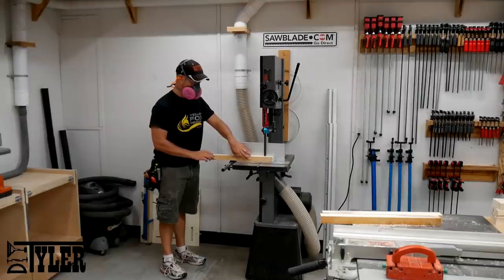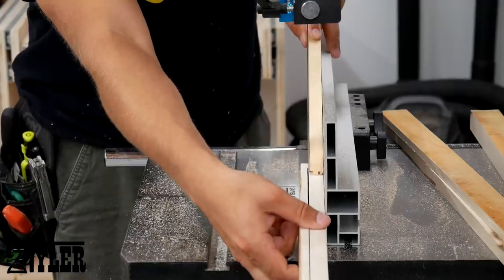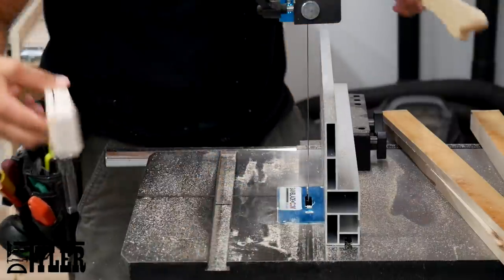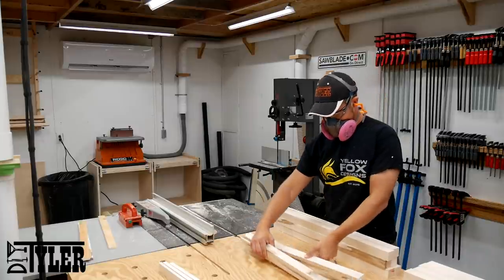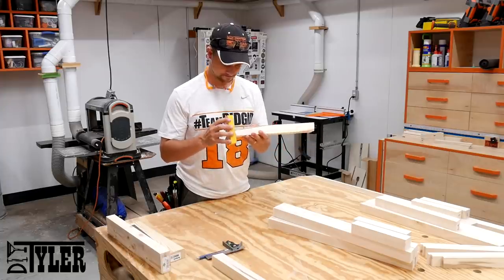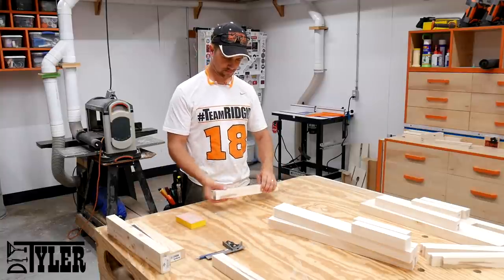There is one small half inch piece that I cut on the bandsaw, and this will attach to the top of the legs - you'll shoot a screw through this to attach the seat top to the leg section. Using a sanding block to get off any little bit of tear out that might be there so that I get the tightest joint possible.